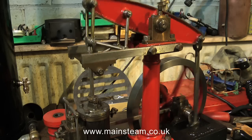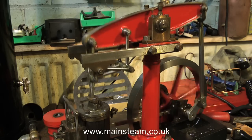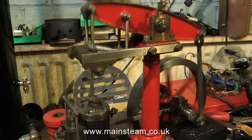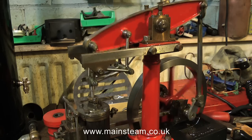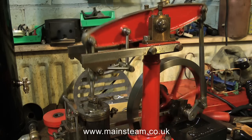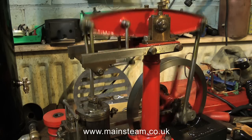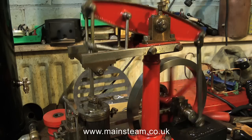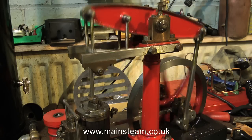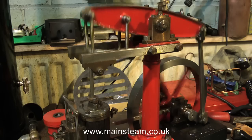If the main two components — the bed plate and the pedestal — are just mounted to wood, which is quite soft, as you tighten the bolts that hold down the bed plate and the pedestal, the pedestal can actually move as it sinks into the grain of the wood, and that knocks the crankshaft out of alignment. I cannot stress how important it is to have the crankshaft at a perfect 90 degrees to the piston rod. Any deviation from this and you will get a knocking sound.